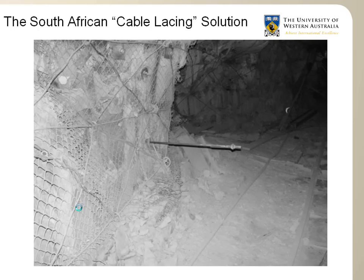The problem with cable lacing is that it requires extensive skill and manual labor to work out how to lace these cables. The work is often performed unprotected with personnel positioned right at the rock face and exposed to the hazard. It is also very slow and delays the development mining advance. Hence, this technique, although very efficient in both mitigating the problem with squeezing ground and rock bursts, has not been adopted worldwide because of the labor component and the hazard component.